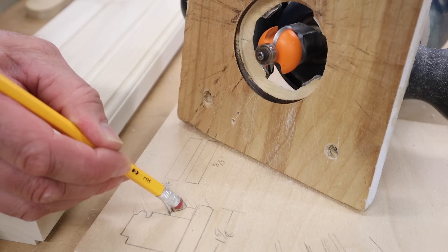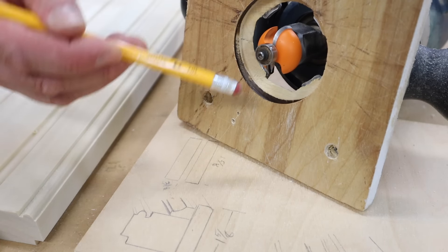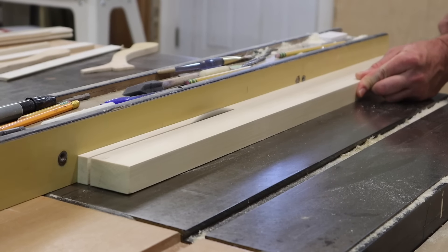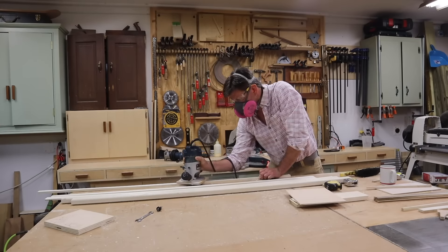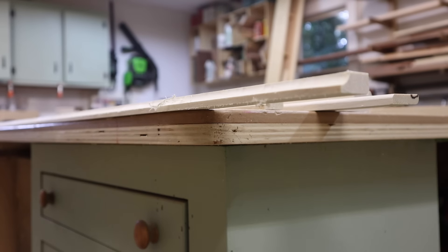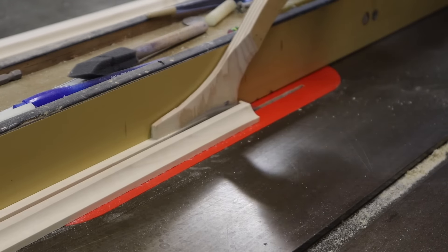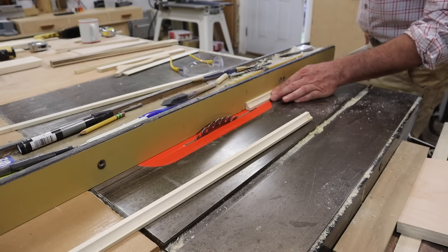The last piece of molding is this cove molding, and to make that I'll use a cove bit in the router. This is a larger router simply because I couldn't find my cove bit with a quarter-inch shank — this router has a half-inch shank — but you can definitely make cove molding with the smaller router. To get started, I'll rip two pieces from the board at a half inch. I've set the fence at five-sixteenths of an inch and I'll use the off-cut for the molding. Then I reset the fence at seven-sixteenths of an inch, flip the molding, and run it through the saw one more time.